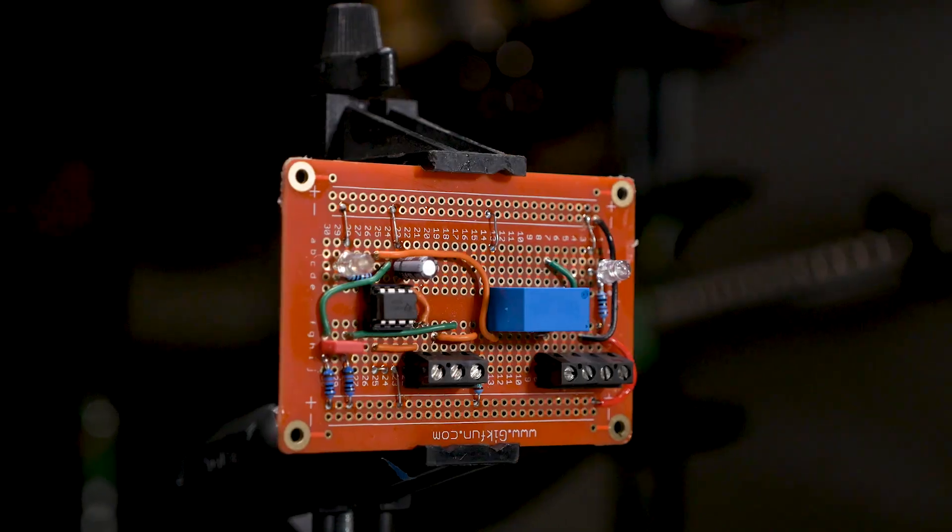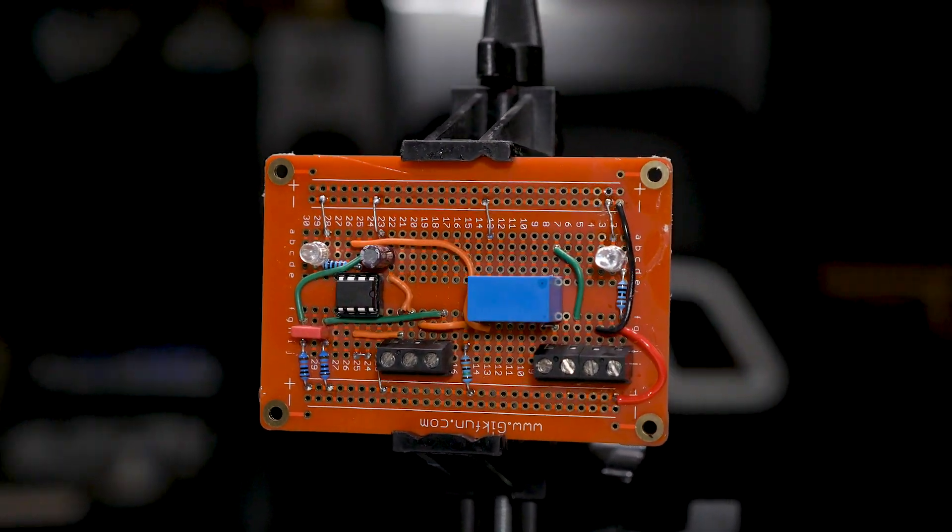The next video is going to be just circuit board creation, building it, and testing it, but at the very least I can show you the finished circuit board. The purpose of this circuit is to connect pins two and three on the XLR connector. I included a potentiometer that controls the fog duration from about one second to roughly nine and a half seconds. There are also a couple of LEDs — a red one that shows it has power, and a blue LED that comes on when the fog is triggered.